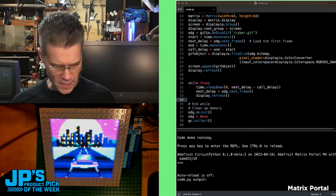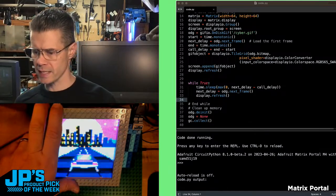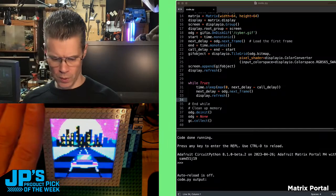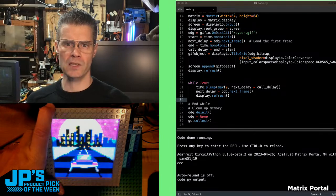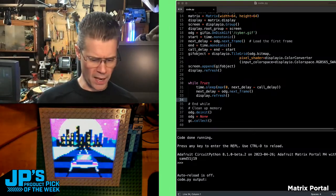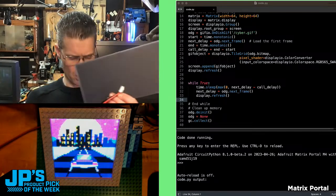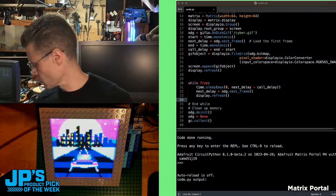What size panel is that? So if your question is about the one that I have on screen here, CET asked, this one is a 2 millimeter pitch. So that's how close together the pixels are. This is a 2 millimeter pitch. I believe this one's a 2.5 millimeter pitch here. And we have all the way up to 6 millimeter pitch, so you can get pretty big ones.